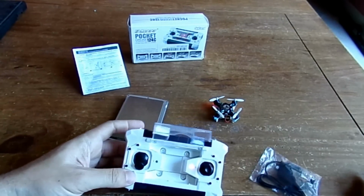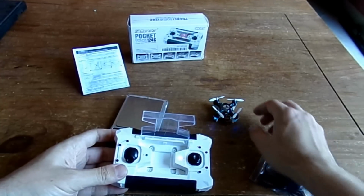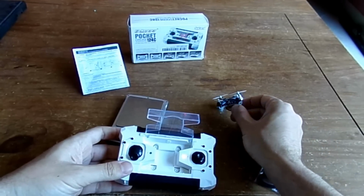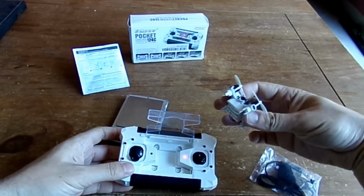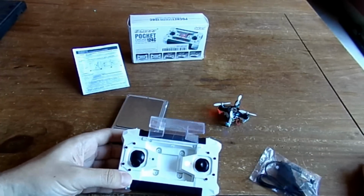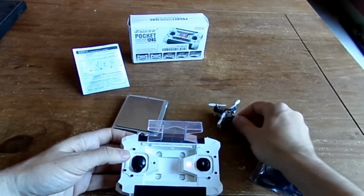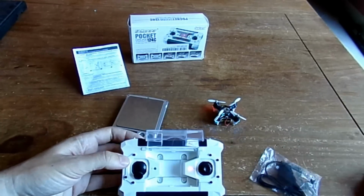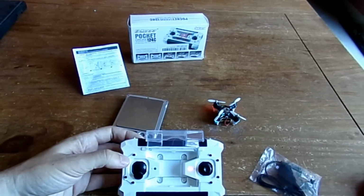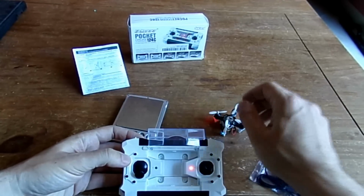When you activate the video recording, so this lower button, you have the rear blue LEDs flashing, okay? And the front stops blinking. And as soon as you release, it will be like this. In headless mode, you have fast flashing LEDs, okay? So you can't be wrong. And when the LVC alarm comes, all the LEDs are flashing slowly.